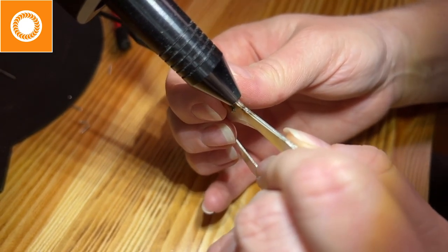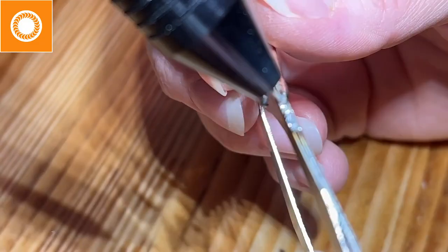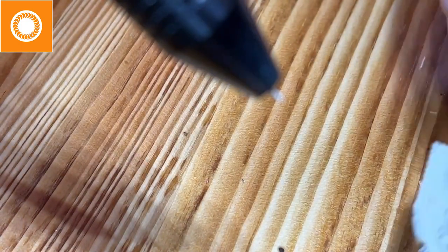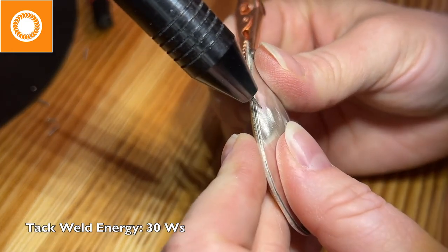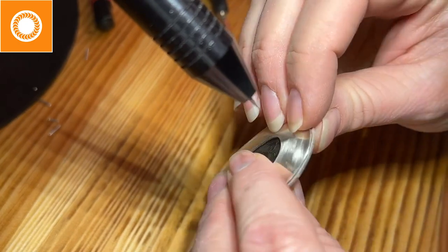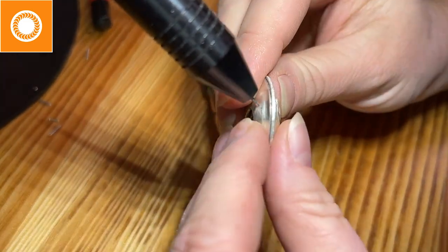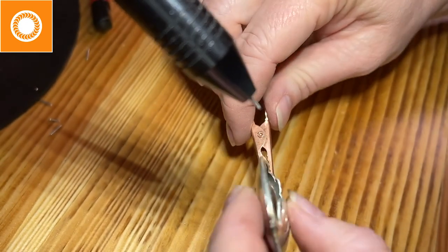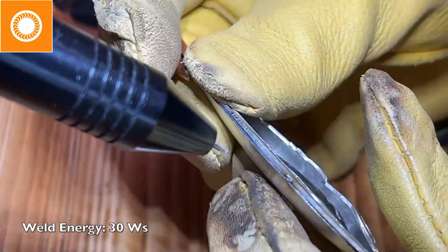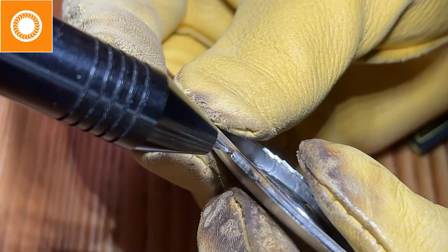At 30 watts I'm going to create my tack welds - just to hold these two pieces together so I can weld the rest. I do have the little clip that you attach to your piece to complete the circuit from the welder to your metal. So now I have three very light welds on here - it doesn't take much to hold everything together. I'm at 30 and placing one weld next to the next. But that wasn't enough so I bump it up to 50. At 50 my welds start to pull and it's not as smooth. My piece is getting very, very hot.